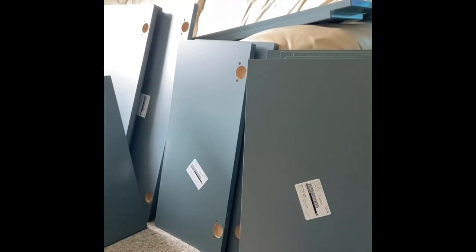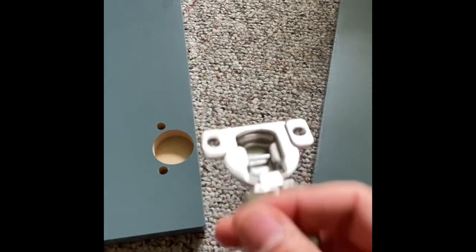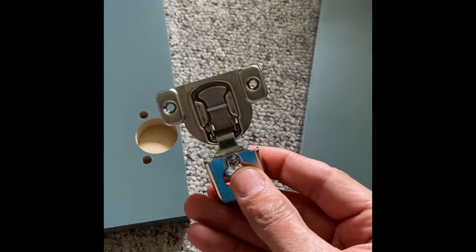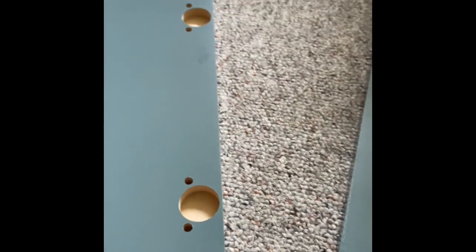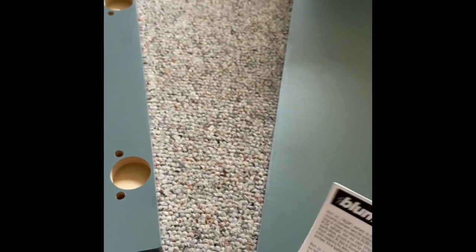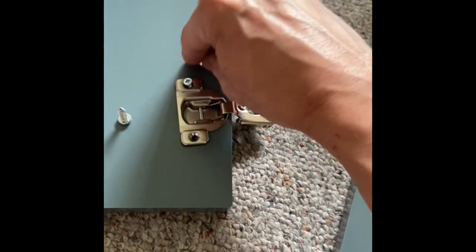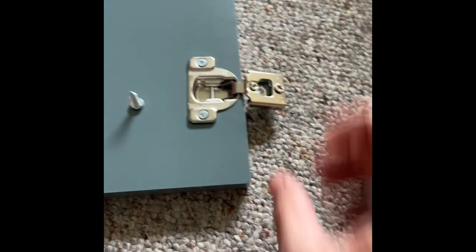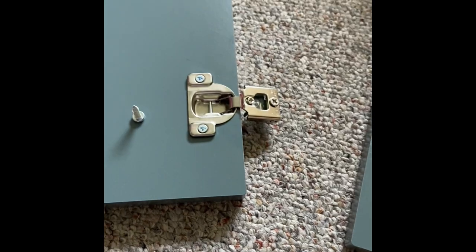After I get the caulking done, it's time for cabinets. Cabinets are in the basement but it's not a big deal. The next step is to get these guys joined up with the Blum hinges — these are for half-inch overlay. I ordered a whole mess of them online. You install them like this — the screw goes inside, and immediately my first thought was: the pilot hole they drilled is too big to get a good 90.